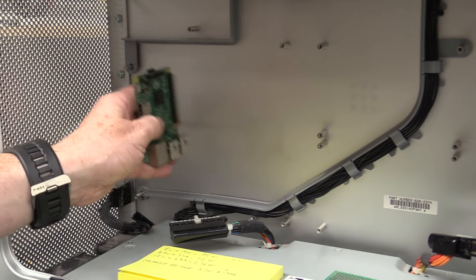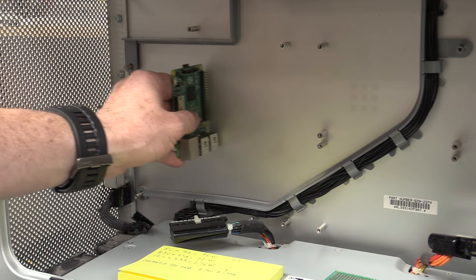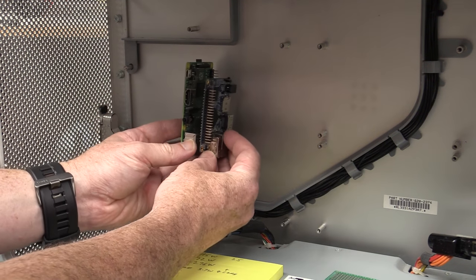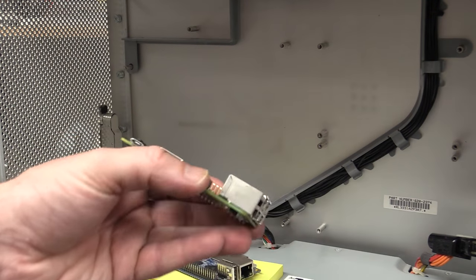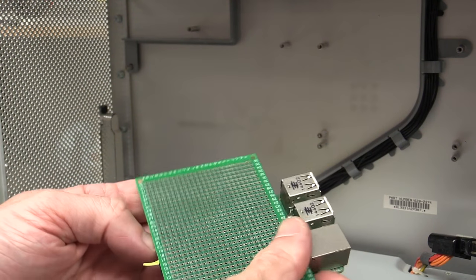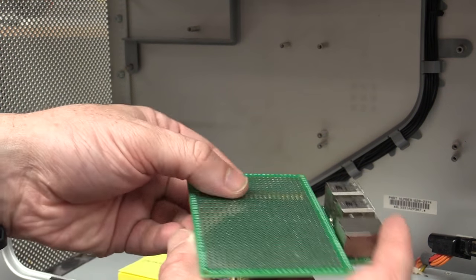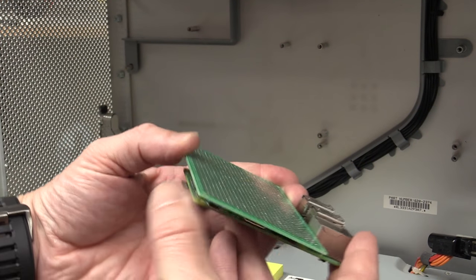So the width. With the slot, you don't lose any space by plugging that in and then moving it over like that. So you can just plug it in vertically. You can fairly densely pack these things like that, because they're basically plugging in vertical. And because you've got the large connectors like the Ethernets and the USB, the header board is smaller than that, but you've got your right angle connector on there. It could be on the other side. Work out the pinout arrangements later, and everything else.